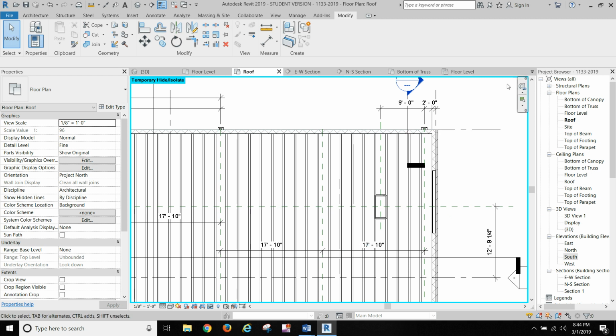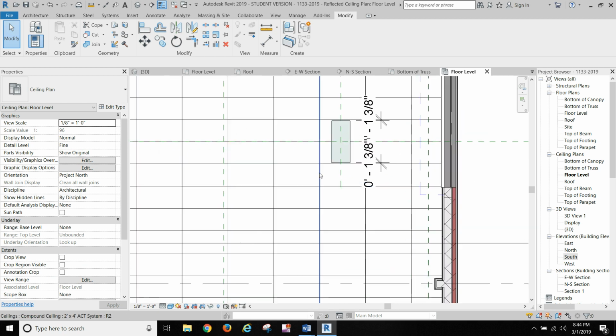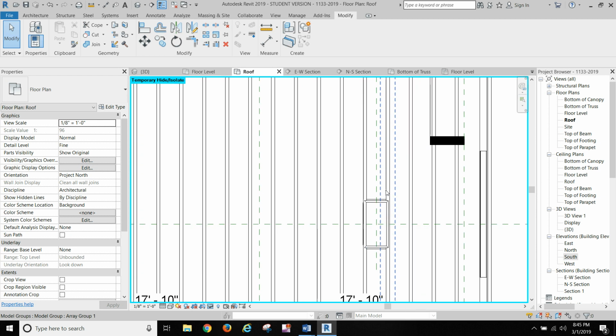And the thing is, you can put it in, but then when you go and look at your ceiling grid, it really looks better if that skylight opening is inside of these 4-foot T's that are running east and west across your building. It just makes a nicer looking roof. Okay, so you want to do that, and of course it's got to be centered between two of our roof trusses.